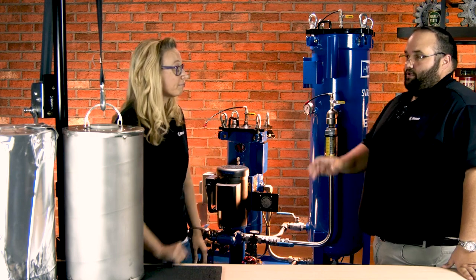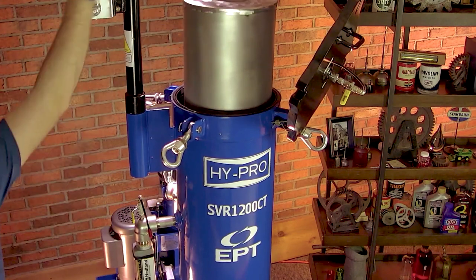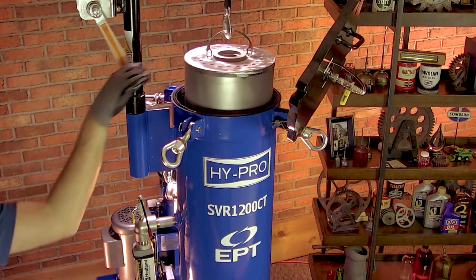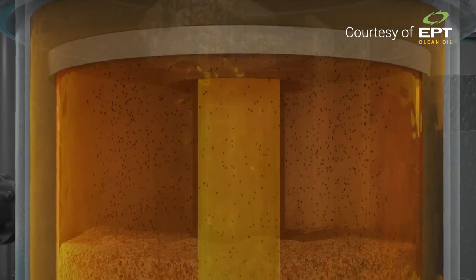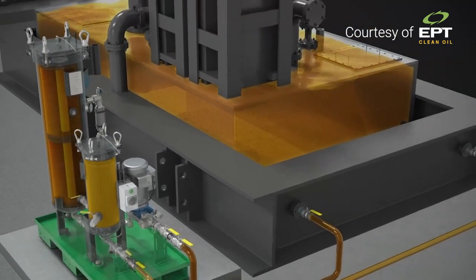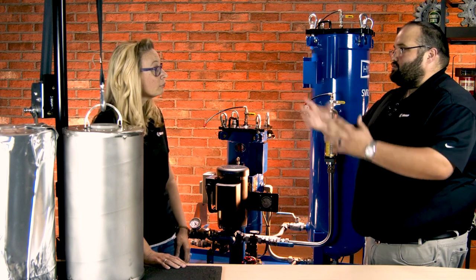So what does this filter do for that? These filters use what we call ICB technology — it's like an ion exchange resin, but far more engineered and far more controlled. With this resin, we can actually target exactly what we want to remove from the system. What makes this so great is we aren't stripping additives — we're only pulling out the bad stuff from the fluid. You can think of it as having a sacrificial surface area, so the varnish wants to grab onto that before it grabs onto anything inside the machine. This is preferential — the surface area here attracts the varnish.